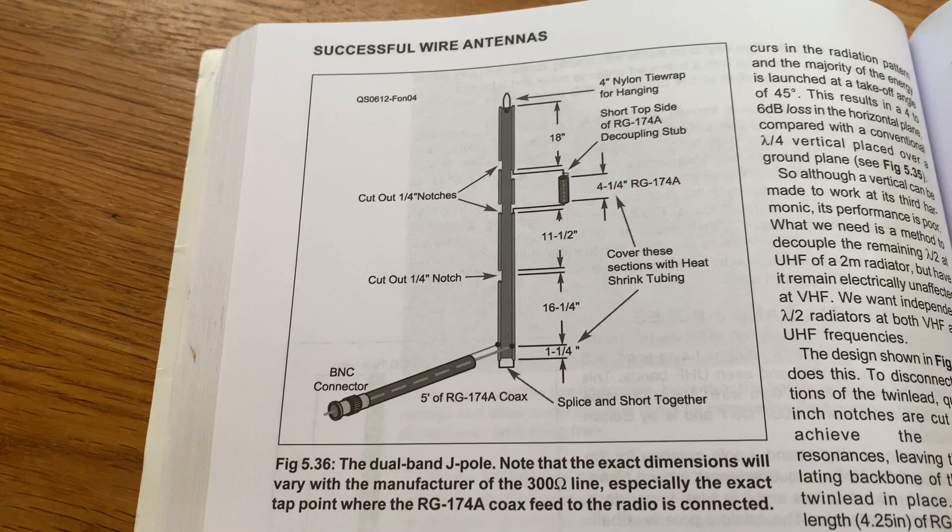So what's the difference between this one and the previous one with the little bit of coax at the top? Well, on two metres, next to none — no difference at all. On the 70 centimetre band, there's a little bit more gain, I think, but I think the other one is definitely better on 70 centimetres — not a lot in it, mind you. Both slim jims work. Both slim jims are incredibly easy to make, as you can see. So I wish you luck. Cheers for now, thanks for watching, bye-bye.